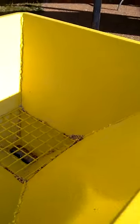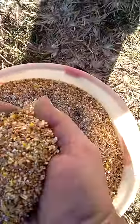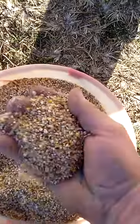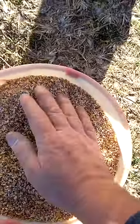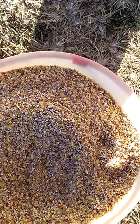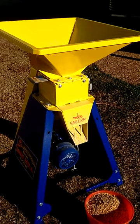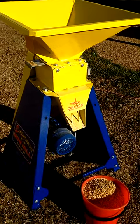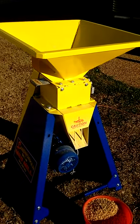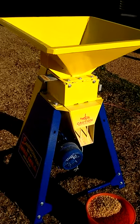So that's it everybody. One thing we want to warn everybody about is don't wind the rollers in until they hit one another — it doesn't help them very much. But as you can see, this grain here is fairly well crushed up. We could still put that through a third time if we wanted to, but it's probably not a lot of point — it's more than we need for the best nutrients for animals. This machine is completely Australian built, all made out of steel — there's no weak plastic parts about it. Very simple to use, and we've sold quite a few of them in recent months. Good afternoon everybody, have a great day.